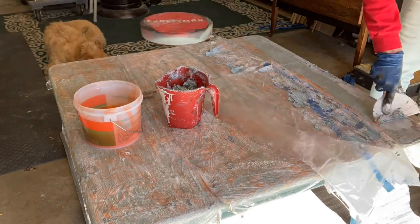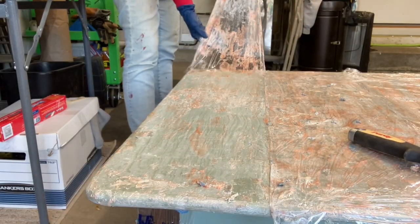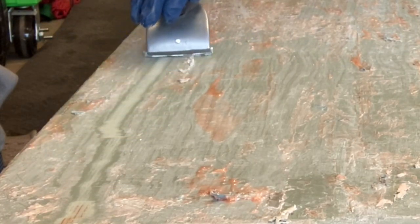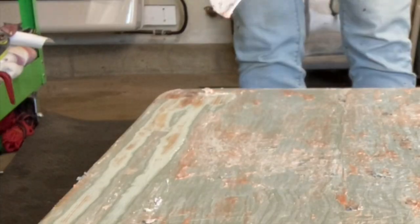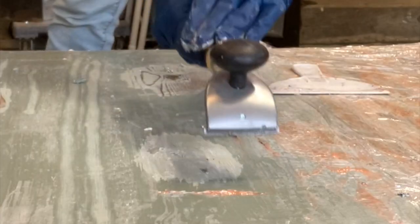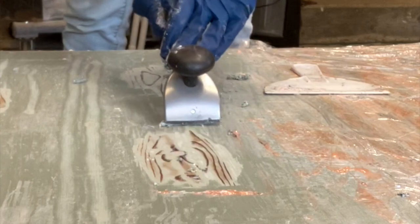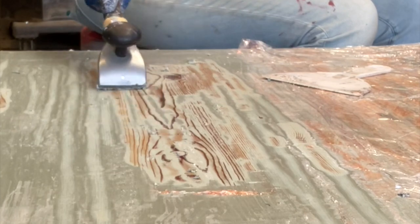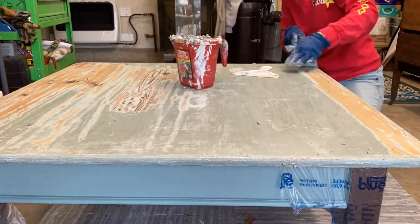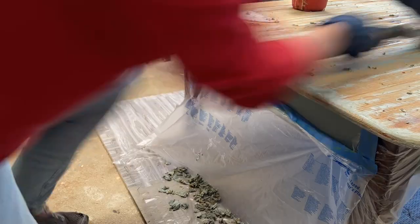It was clear to me that the second time around it wasn't coming off as well as the first, so I decided to get out my carbide scraper. A lot of people swear by the carbide scraper — I'm still a little skeptical — but I have to say in this instance it worked very well. It pulled the paint off. You pull the carbide scraper towards you and apply pressure from that little knob on the top. You don't want to push too hard because that will scratch your wood, but if you apply the right amount of pressure it works very well.